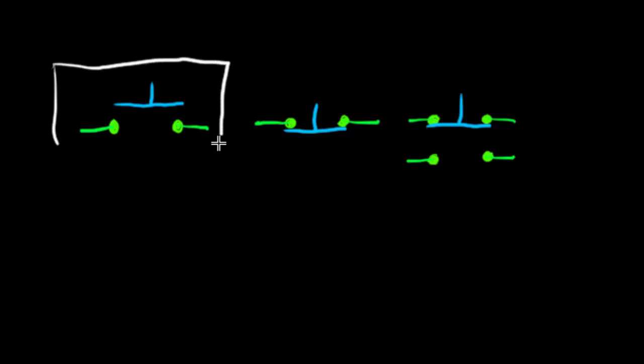This first schematic symbol is probably going to be the most common, and this is what they call a normally open push button — because originally, when you're not pressing it, the connection is open or it's off. The two green leads here are essentially those two terminals or metal leads. The blue part represents the actual button that you would push. When the button is not being pushed, the two green terminals are not connected — it's an open circuit, hence a normally open push button. When you do press the button, the blue bar moves down and makes contact between the two green leads, closing the circuit.